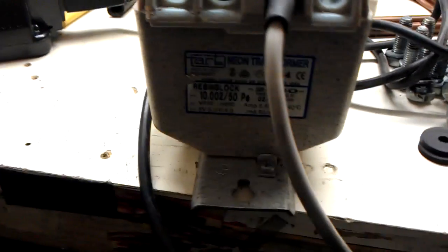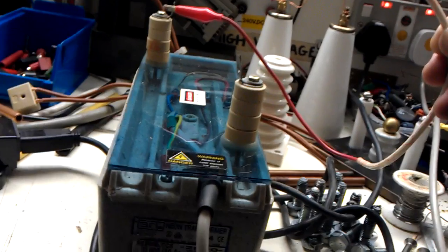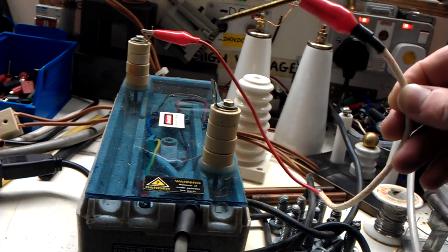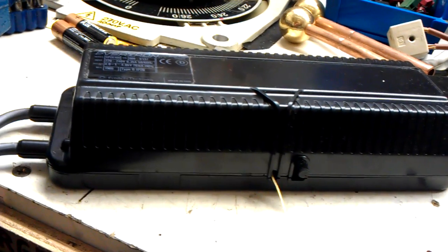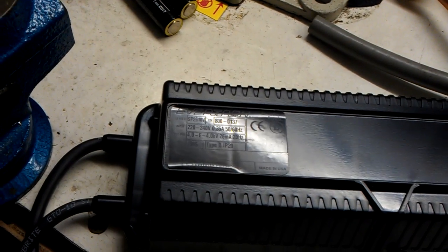See, the arcs are quite big. The milliamps on that one — on this one — are 26 milliamps; on this one it's 50 to 65 milliamps. As you know, the voltage gives you the length of the arc, and the amps give you the thickness of the arc. It's a little bit more length on this one. I don't believe this is actually 10,000 volts — it says 4.0, so I think that is actually 8kV.